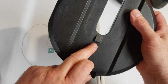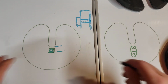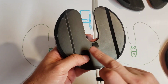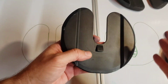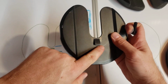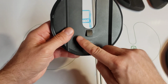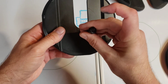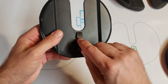on your disc. So anyway, hopefully for you guys out there that have discs that have sheared off their tabs, you now have a couple of methods that you can try to salvage that plate if you're handy. One is prying up the underlying steel tab, and the other is grinding this off, drilling it, tapping it, and installing a bolt or screw head in place of the tab.